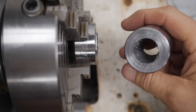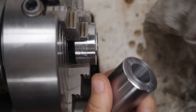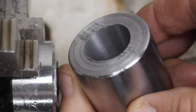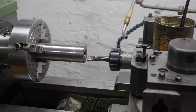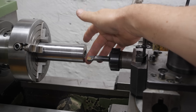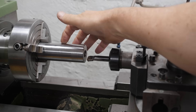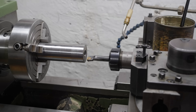Although this part is scrap, I'll still run the cutoff tool path to confirm it works and that I've got nice clearance on both sides of the tool so it doesn't nip up again. It put some nice scratches on both sides — useful for surface grinding off to check the internal surface finish. It's looking pretty good, definitely better than the first one. This is now going to be our third attempt — let's hope this time I don't jam at all while trying to remove swarf, and let's hope the cutoff works.